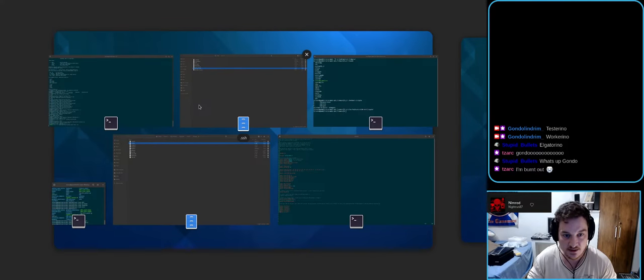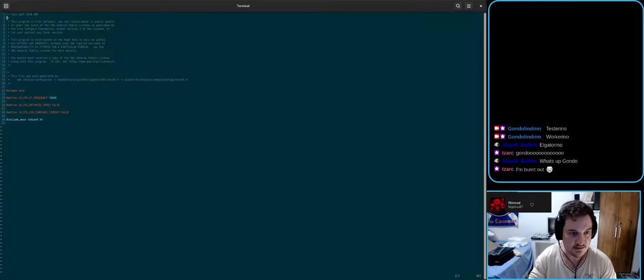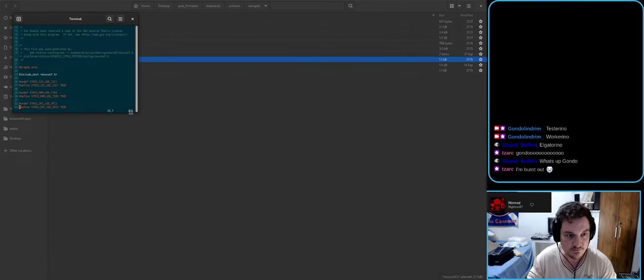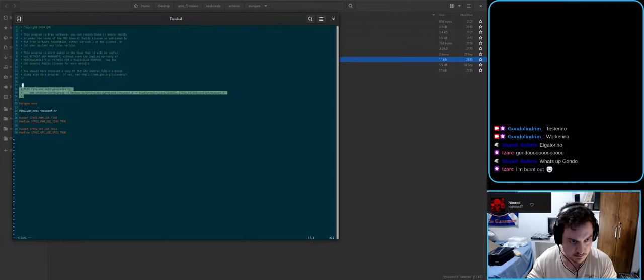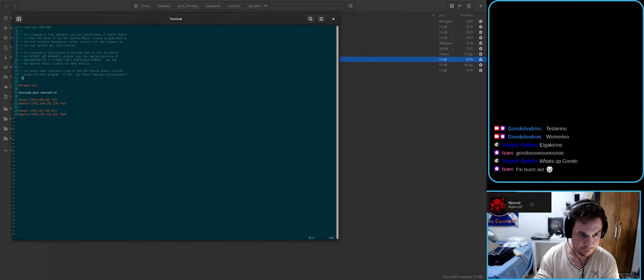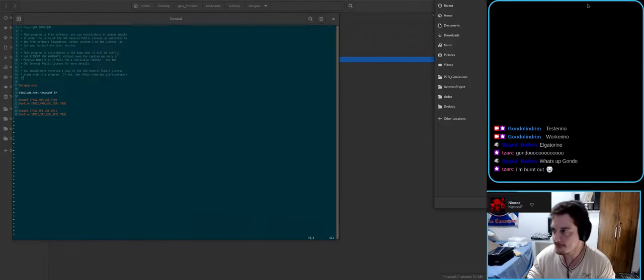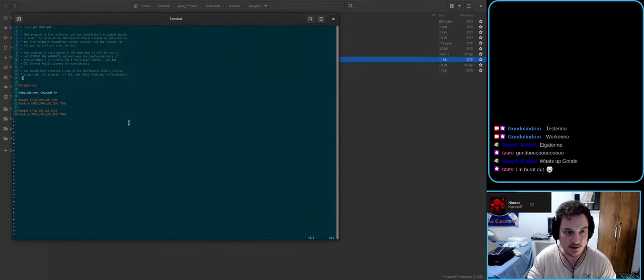Nice. Then we have the RGBs. The RGBs are done with the SPI driver. CHConf, that's not this, but let's just move this here. Nice. Microcontroller configuration. Use I2C. I have no idea why this is using I2C. It shouldn't. Timer 3, that's for the LEDs, right? Let's say PWM A6, that's timer 3. Awesome.